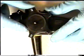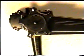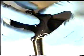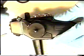We will now adjust the up-down knob. Olympus knobs are usually very tight. You can, however, loosen them a little bit by taking a pair of dividers and fitting them into the 2 holes on the ring on top of the up-down knob. You can unscrew this ring and remove it, taking off the knob itself from the up-down assembly.